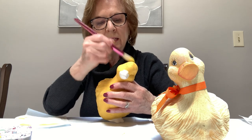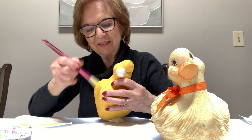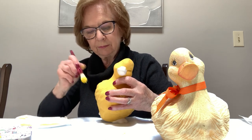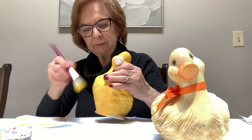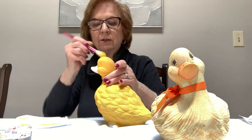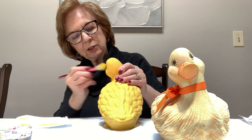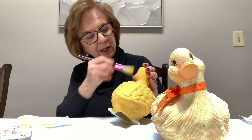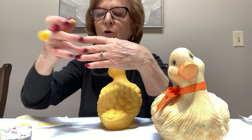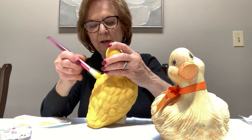Do the whole piece at least once with a light hand, always against the grain. Up here the detail is going vertical, so we're going to go horizontal. Twist the brush around and blend it together. With the sunlight it's very hard to see, but you should be able to see it as you're doing it. Now that I know I don't have a lot of paint in the brush, I'm pressing a lot harder — always against the grain. The grain is going this way, so I go the opposite way, so that you don't get it in the crevices.